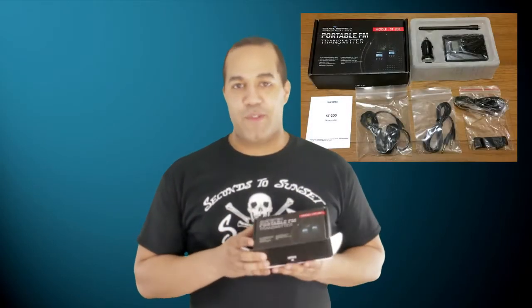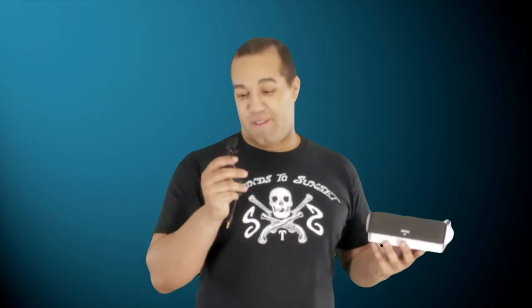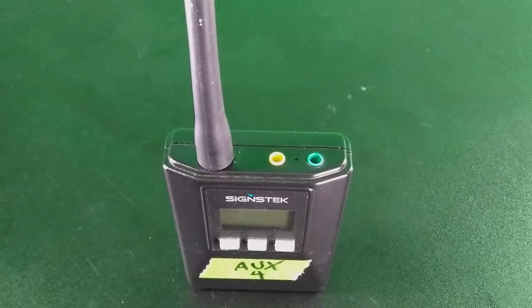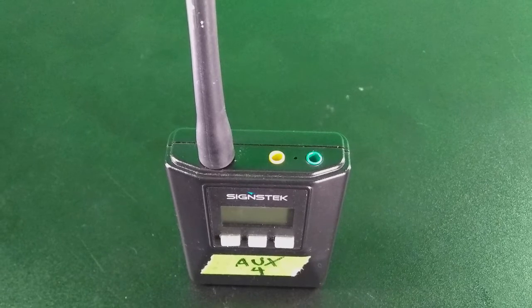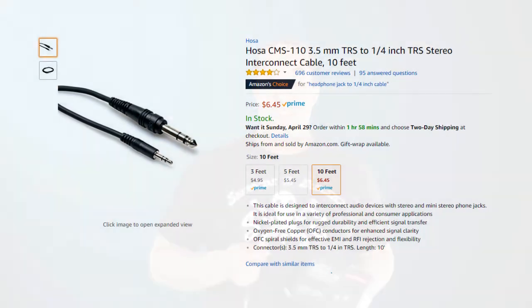By the way, these transmitters come in a box with a bunch of useful adapters and cables, and even a lapel mic. So you can even use that to send signal to the transmitter as a last resort. Put the lapel mic on and keep the transmitter in your pocket, which works just fine since it has a lock button on it. For our purposes though, since our mixer uses 1/4-inch aux outputs and the transmitters use 1/8-inch input jacks, if your setup is similar, you'll need to either use an adapter or buy 1/4-inch to 1/8-inch cables like we did. Those cables, like everything else, are linked in the description.